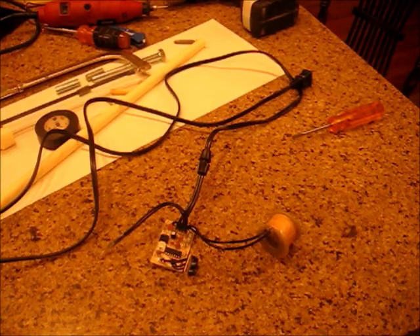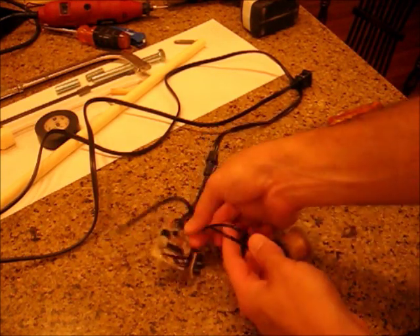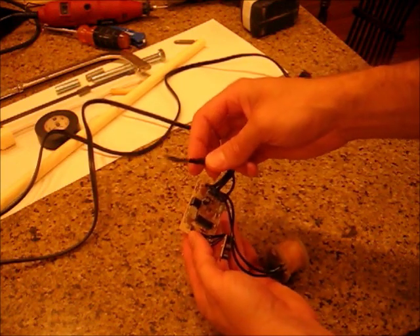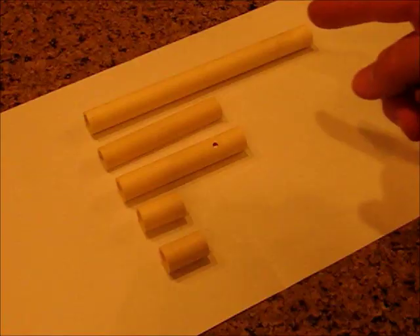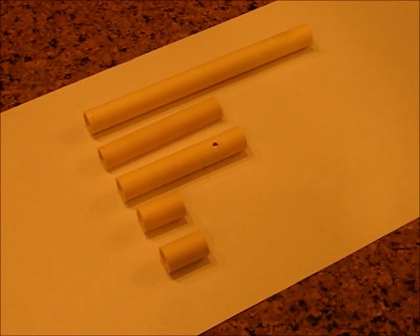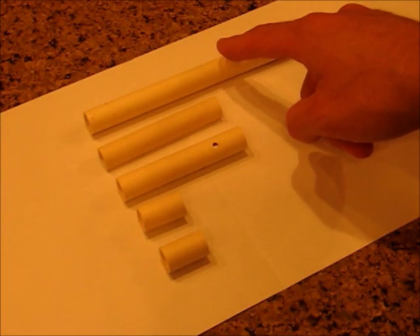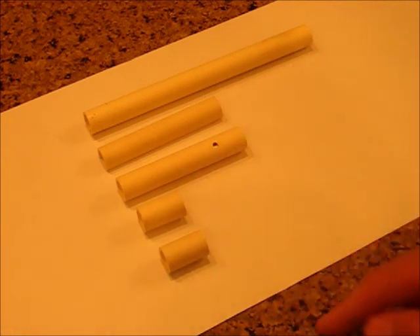You'll find a lot of other parts inside the stapler, but what you really need is the coil, the circuit board, and the trigger mechanism. There's also usually a little light, and it's all hooked to a plug. Using a hacksaw or any other saw, cut a piece of tubing that's seven inches long, two that are three and a half, and two that are one and a half inches.